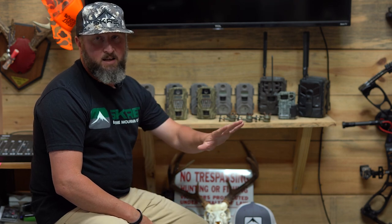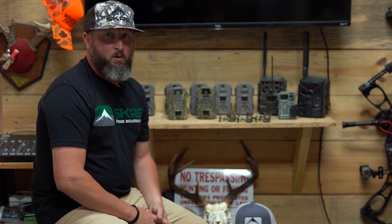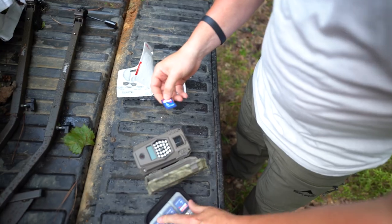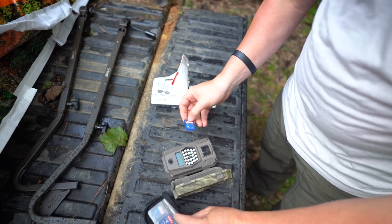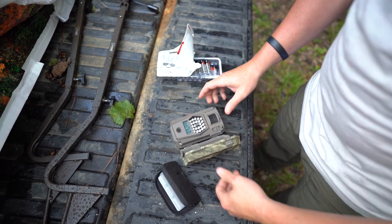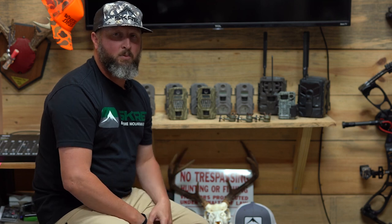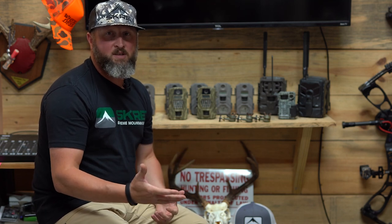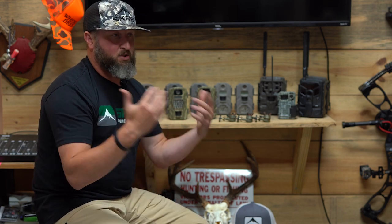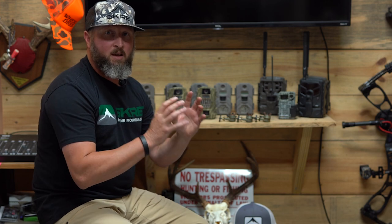A couple of tips for getting the best results from your cameras. I don't run cameras all year — I put them out as I'm getting ready to start scouting and preparing for the season. I always bring cameras out of the woods, clean them up, take the batteries out, take the SD cards out, and take care of them like any electronic equipment. When I get ready to use them again, I put in formatted SD cards, make sure I'm using the right card class for that camera, and put in new fresh batteries. I test them before going into the woods — there's nothing worse than disturbing a spot and finding out days later the camera wasn't working.